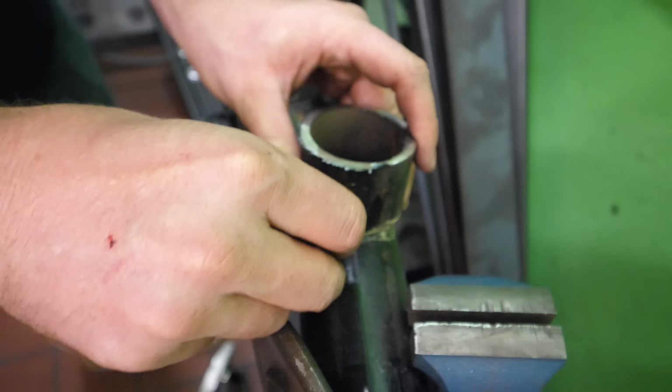Next, I need a place to put the mast. I need the mast step, which is the tube the mast goes into that holds it to the spine of the boat. And you can either put this at 10 degrees, kind of canted backwards, or you can put it vertical. And on my previous boat, I did 10 degrees and it made the back end a little fishtail-y. So I'm gonna try vertical and see how that goes.